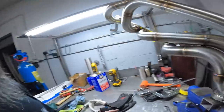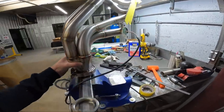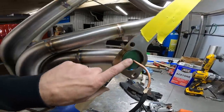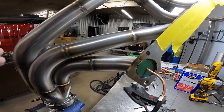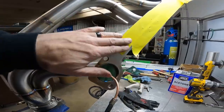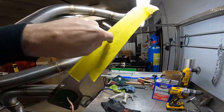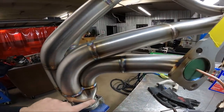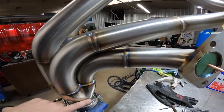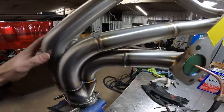And hopefully I know what I'm doing. So as far as the purge, while I'm doing this, I usually just throw a purge plug in there in the shortest primary and turn it up to about 15 or something, and throw some yellow tape across the other primaries, poke some vent holes in each one. That way when it pumps down here and fills this bottom section up, argon's heavier than air, so it's gonna push the air out here, get that out of there.